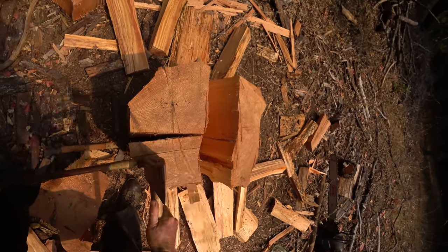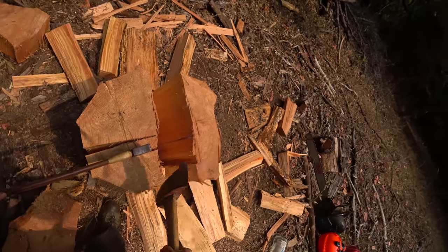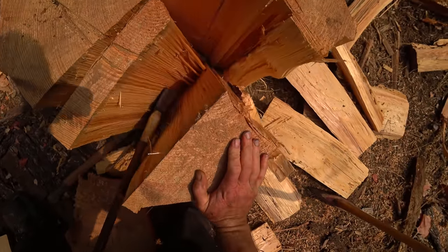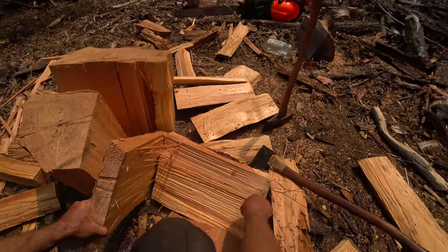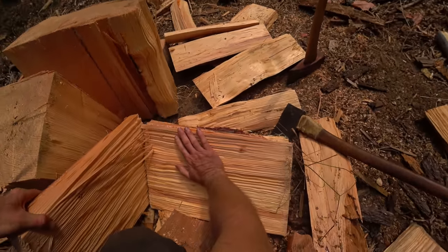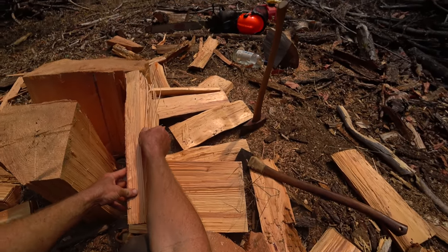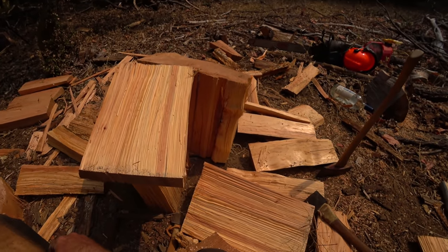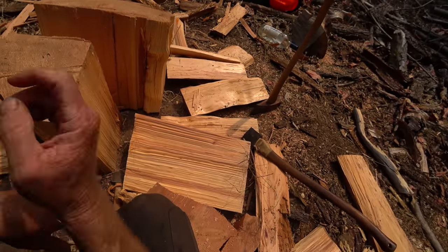As soon as I feel it kind of bottom out, I'm gonna move. Now I can see the crack running a little down the side of the log. You hear that hollow sound? With really straight-grained, well-behaved woods like this, you can get away with this. But a lot of woods, you will find that will not work — the board will run out and rip down to a thin taper on one end and you'll end up with a wedge. In an emergency, if you have to do it, you can just make the board thicker, let it run out, and then chop it down to the right size. That is just gorgeous — I could probably make a breadboard out of that thing. I already split off a bunch of sapwood that was kind of rotten.